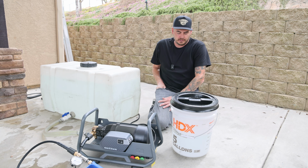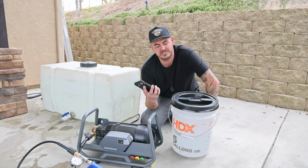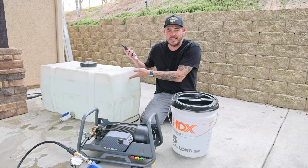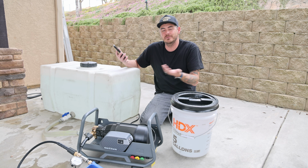So let me go ahead and do that calculation. Yeah, we lost a little bit, but we're still at 2.15 essentially. It's 2.148, so we're gonna round that up. 2.15 gallons per minute out of a mobile unit. I mean, gravity fed, that's incredible, right? We're still getting basically the 1100 PSI and 2.15.